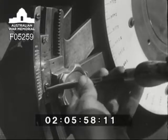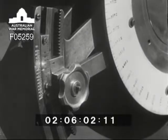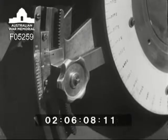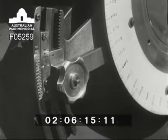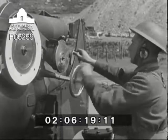The sight setter, meanwhile, prepares for testing the sights. First, by slackening off the fixing screws, he moves the charge temperature and muzzle velocity strips to the normal position, and screws down firmly. This is most important, and although only a small adjustment, it should not be forgotten. Then he sets his range dial and deflecting scale at zero.